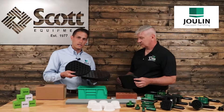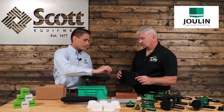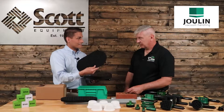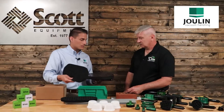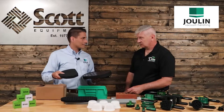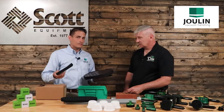In this situation, we're using the check valves for this foam. Obviously, you can see the pattern there. This foam specifically is actually for picking and handling indented products, like cans or cups or something to that effect. You can actually change this out and then go pick those cans and that product as well — you can change these out very, very quickly, even if it's on the same system.